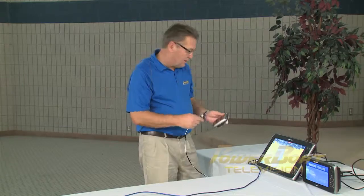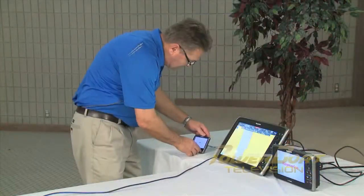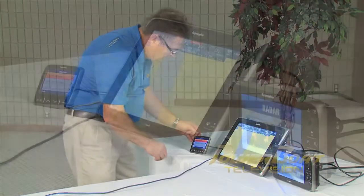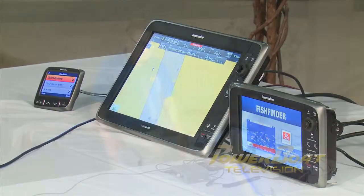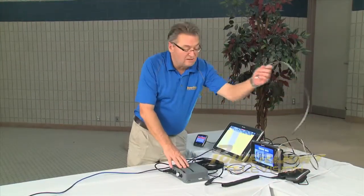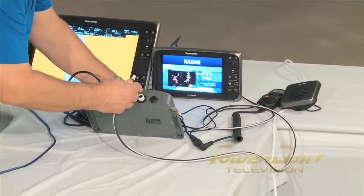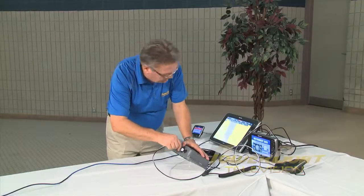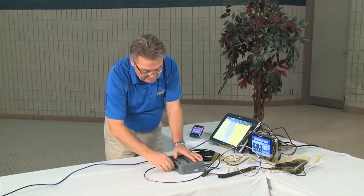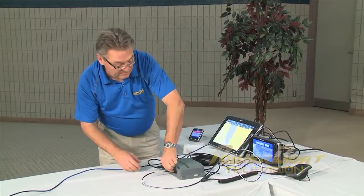A real simple addition to the NG network here is to put in one of the I-70 displays so you can get all of the extra data on an additional screen from the various systems in the boat. And again, it's quite simple — just plug and play with the correct length of cable. One of the first things you want to do once you have your VHF in position is add it into the network using one of the cables and putting it into one of the connector strips to the ports, so that you're sharing position data from the GPS and the MFD with the VHF for the digital selective calling features of the VHF radio.